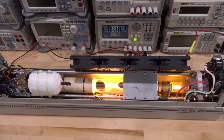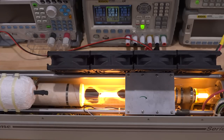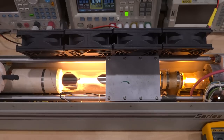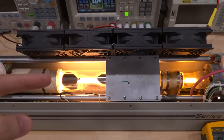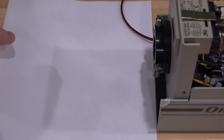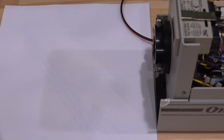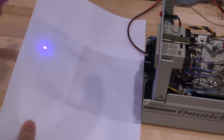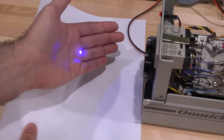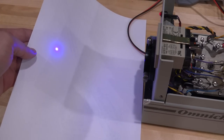The fan is on — look at that! That is super beautiful; the colors on camera don't do it justice. This is obviously not blue yet — we're expecting blue — but that's the incoherent light coming from the cavity itself, and we're going to measure that. There's a lot of cool information embedded in there. Still no laser coming out; it's going to take a few minutes to stabilize. The color is slowly changing — you can see the mirror finish there, which is cadmium buildup on the inside of the wall. A tiny spot is forming but it's very dim. After a minute or so — check it out, that is a beautiful blue light!